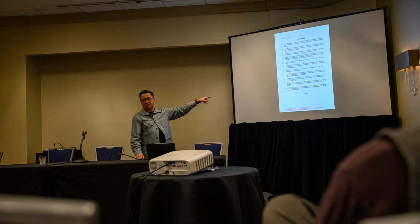The Zwislocki coupler was, however, known to have large sample-to-sample variation and be difficult to tune due to the 4 branches. Now, by branches, we're talking about the volumes that they use to help, well, not to help, to shape the transfer impedance, to shape the response of the simulator. And so they use these branches, these resonators. Zwislocki actually had 4 of them. The 711 standard we use has 2.